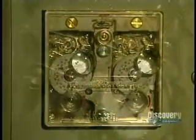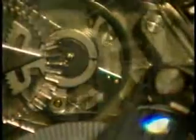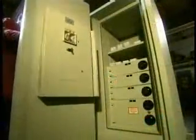Then, in the finishing department, they install the mechanical or electronic locks and locking mechanisms, as well as the internal time lock mechanism. The time lock allows access to the safe only at certain times of day, such as a bank's business hours. Even if someone picks the outside combination locks, the door won't open outside those set hours.